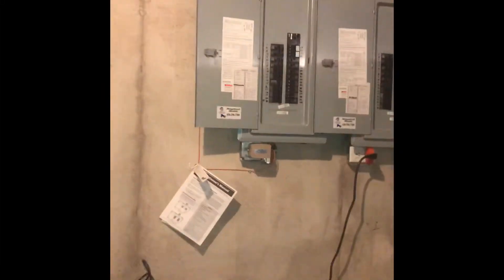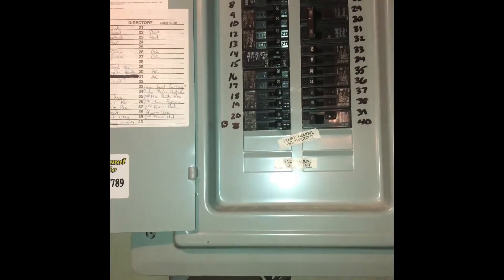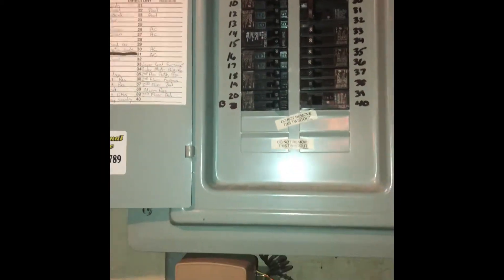The next video will be in the basement at the breaker panel. We are in the breaker panel right now. It doesn't matter which one of these panels you want to go out of, but there's less getting taken out of this panel, so I think this panel will work best. I'll come out of this panel, run our electrical up to the ceiling and across, and right here is where we're going to be penetrating out to go into that garage, somewhere in this corner.